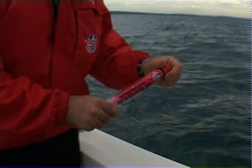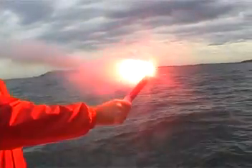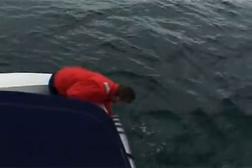To light this flare, hold it safely at the base, twist off the top cap, and hold the handle with the signal pointing up and away from you. Firmly pull out the yellow igniter knob on top of the flare in a smooth, steady motion. Hold the lighted signal up high outboard on the leeward side of your boat. Dispose of the used signal, which will be very hot, by putting it in water.